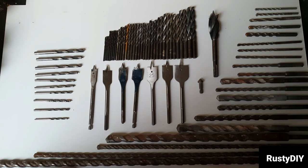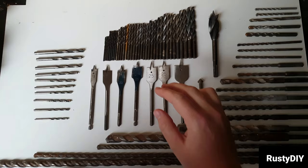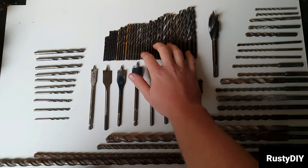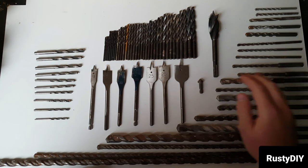You would definitely need HSS bits if you're going through metal. First tip: make sure you use the right drill bit in the right material — using the wrong bit is probably the quickest way to destroy both the bit and the material. Second tip: don't let your drill bits get too hot. If the end gets really hot in the hole, no matter what bit you're using, it will likely melt and damage the cutting edge, making it useless. Third tip: I predominantly buy HSS and masonry bits — they cut most of what I need, with masonry handling the rest.